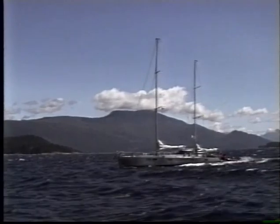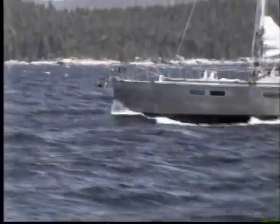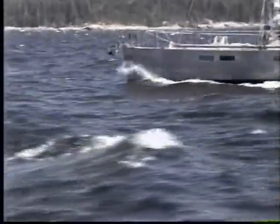But when the wind is on the nose, drag goes up and so does fuel consumption. We're heading into 30 knots of wind here with a 3-foot sea trying to hold us back. In these conditions, we'll burn about 3.5 gallons an hour at 9.5 knots, and our range drops to 1,600 miles. For every set of sea conditions, there's an optimum powering speed. Right now, Sundeer is very happy at 9.5 knots. But if we were to slow her down to 7.5 or 8, she'd start to pitch a bit.